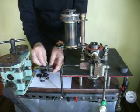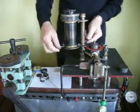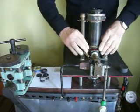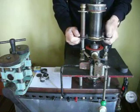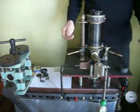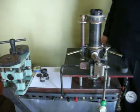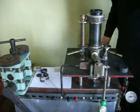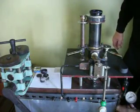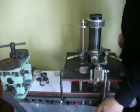First, Stasha assembles the mold, adds the appropriate amount of metal, puts the top on, and simply places it in the furnace. Then he brings the top of the furnace down, locks it in place, and then he'll turn on the vacuum pump to bring up the pressure. Turns off the pump, turns on the power.